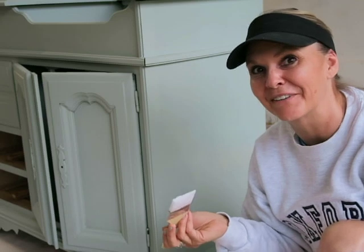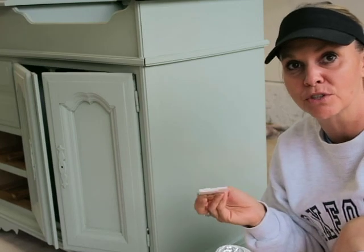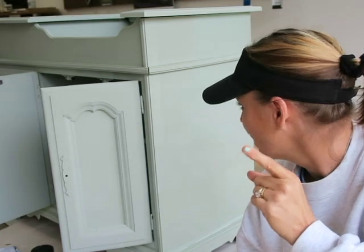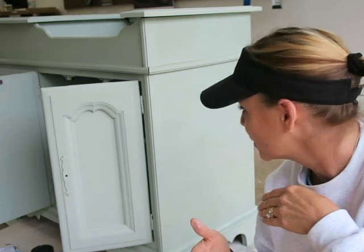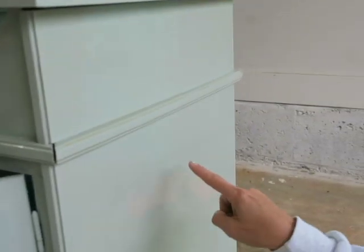Since I have to move quickly and don't want to keep moving my camera around, I'm going to get all the crackle on just like painting a single coat, then let it dry and come back to show the topcoat. I just put the coat of crackle on and I'm going to let it dry overnight because it's raining. I also just found out you want to put it on in a thin coat — because painting vertically, if you put it on thick it's going to run.